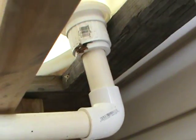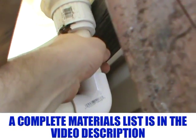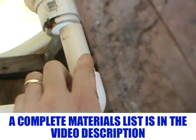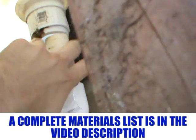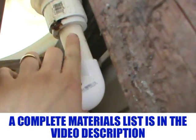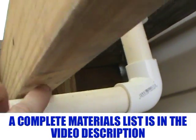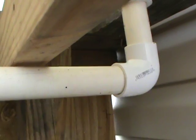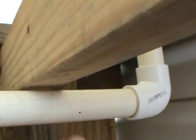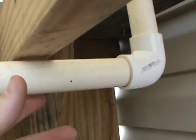Now that we're under the barrels, the one next to the house, we've come off with just a piece of PVC pipe. This is just barely mounted for the moment to give an idea of how it needs to be run. You want to size your pipe so that as you come down, we'll be able to take a metal banding and put it around the brace support to hold it in place so it doesn't work loose over time and get cracked.